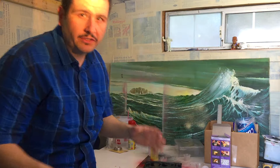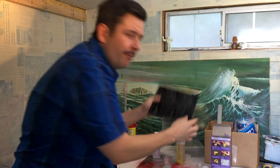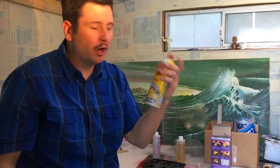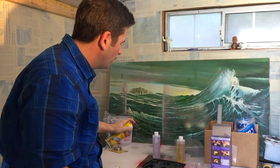Not the most ideal setup as far as trying to show you guys what's going on, but I'm going to do it anyway. I've got my amazing casting resin right here and I've got my mold. I learned my lesson the first time — you've got to spray this thing with some mold release or else the plastic isn't going to come out. I recommend you don't use Pam because I'm finding it kind of coagulates, separates, and does weird stuff — everything looks all rough and nasty.